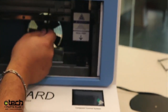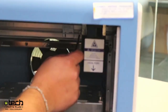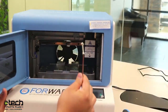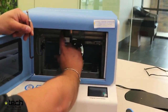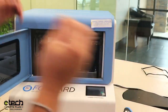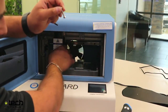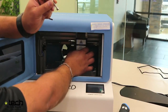There's a screw right next to the laser head that says 'need to dismantle screw.' It's very important you take this off — it keeps the laser head from moving. If you don't take that screw out, your machine is going to make a clicking sound because it can't move across the laser arm. It's possible you may get a zip tie instead — if that's the case, just cut it. Whatever is holding the laser head in a fixed position needs to be removed so it can freely move.